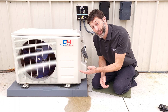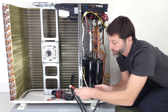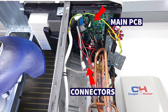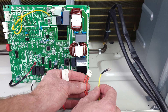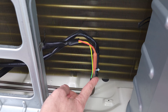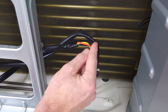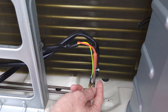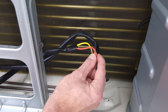Now we're going to do some testing on the base pan heater itself. Normally you'd do your testing in the electrical compartment, but for this video I've removed the fan blade and we're doing our testing down low by the base pan heater itself. In the electrical compartment you'd have your main PCB, your connectors, and you can just disconnect it and take your electrical resistance readings. I've slid this rubber protector up here — you can see this one still has a zip tie on. There's a sealed rubber connection here because there's a lot of water and moisture in this location, protecting the transition from the electrical resistance wire to the actual copper wire.